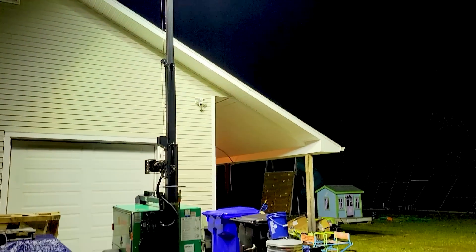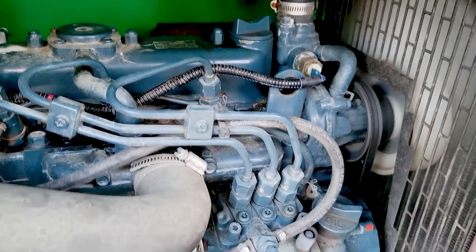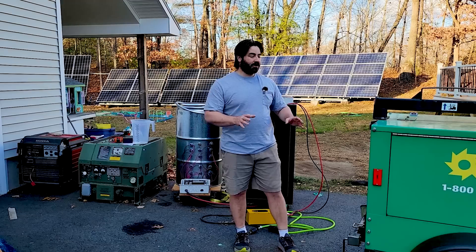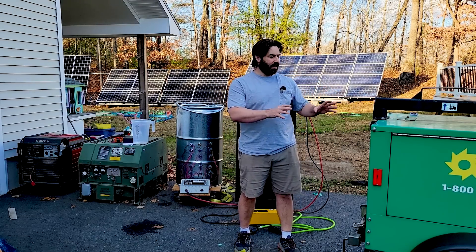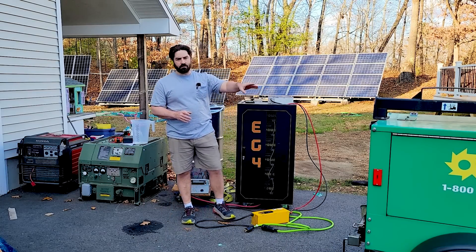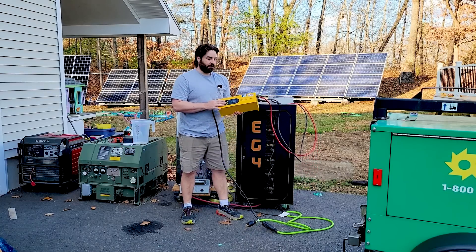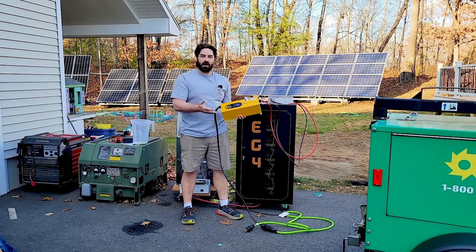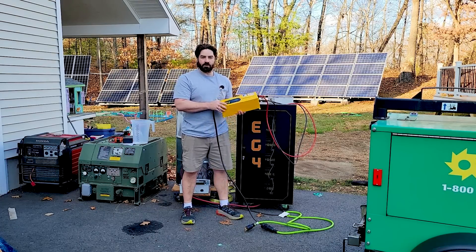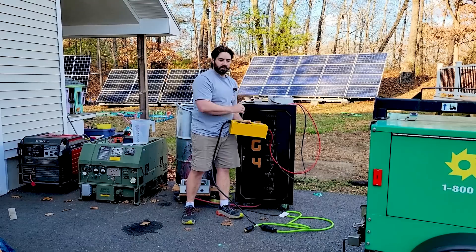This light tower is a liquid-cooled three-cylinder Kubota diesel engine. These things are known for just purring along all day at job sites and being very fuel efficient, so I can't wait to test it. However, they're not known for good quality power — the electricity is known for fluctuating in voltage and hertz, which would matter if you're connecting it to your house. But it doesn't matter when you're using the charge inverter, which can take in a wide range of hertz and voltage and still puts out a very consistent 48-volt charging voltage, typically about 54 volts when charging the battery bank.